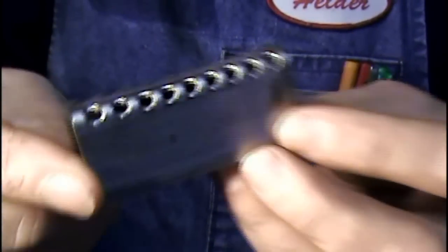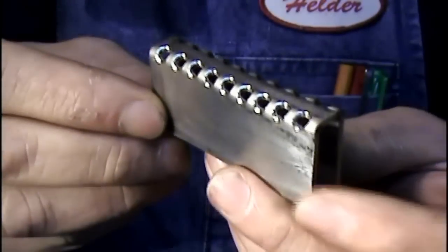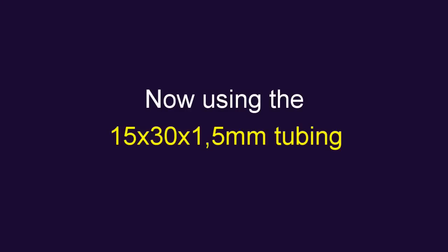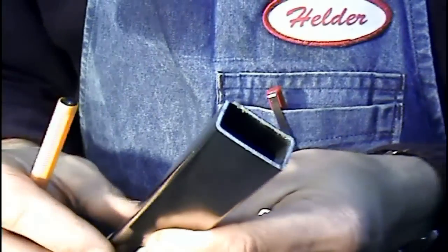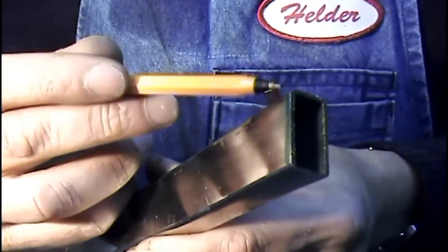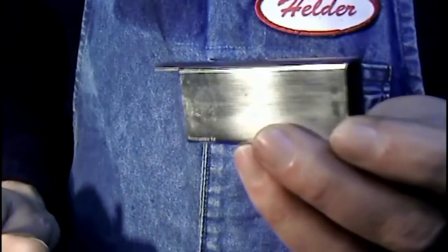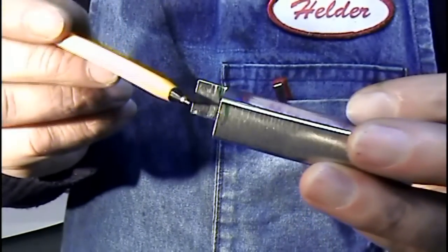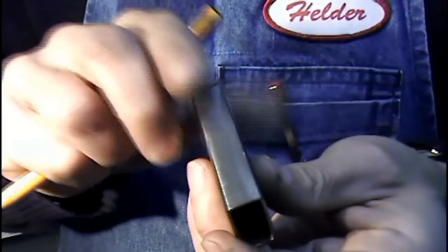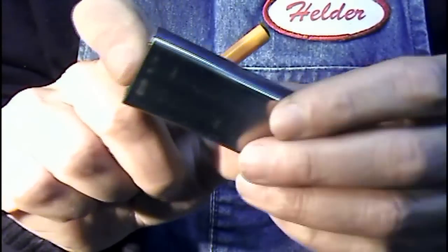Check this out — I just have one word to describe this: beautiful. And these holes on the top, they just look amazing; it reminds me of a muffler from a racing car. I think this is going to be like the coolest looking trigger mechanism on YouTube. There's also a much easier way to make a trigger housing. From this square tubing — 30 by 15 by 1.5 millimeters wall thickness — I cut off a piece and end up with something like this. On this one I left a tab just for looks. I may put a screw hole on the top, and once I transfer and drill all the side holes for the pins, I just have to cut the bottom off, file everything down, get everything on size, and the housing is done.